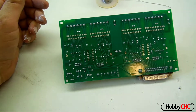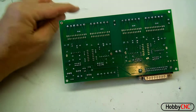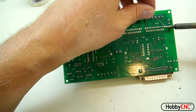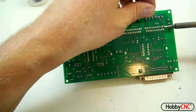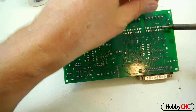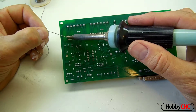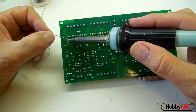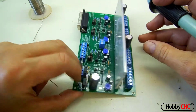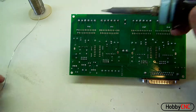Gently set it down. These outside four pins take a fair amount of heat because there are large circuit board conductors on both sides. So I'm just going to tack a couple in, tack a couple at the far end, stop and make sure we're still nice and straight. I'm pleased with that, and then continue soldering the remainder of the pins.